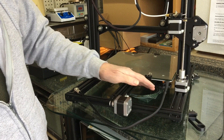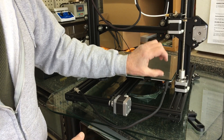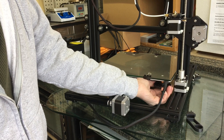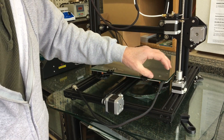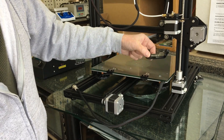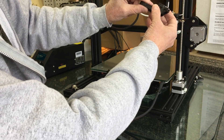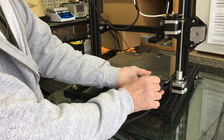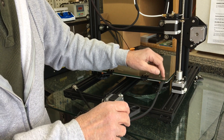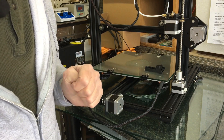What turned out was this: there's a spring in here and it compresses, and this is what moves the table up and down according to this little thumb wheel — the adjusting knob underneath. This part right here was installed at the factory on here, and particularly this part right here was stopping the screw from completely compressing, so I was never able to get my nozzle off of the bed. I'm going to show you that close-up now.